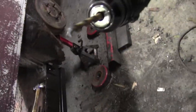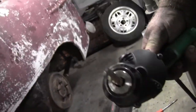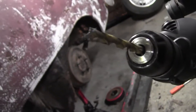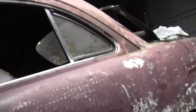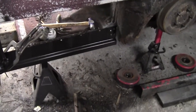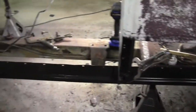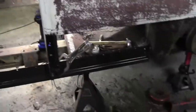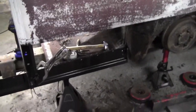If you haven't seen it on Fitzy's Fabrication — what I did was I painted it, then I took a quarter-inch bit, ground the tip flat, and you can go right inside the hole and it gives you a good spot to weld to. So I'm going to get this burned in and then start working on that outside rocker panel.